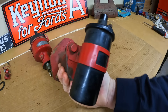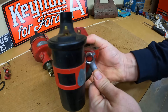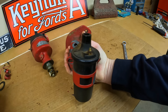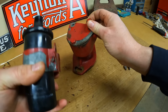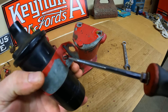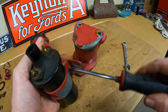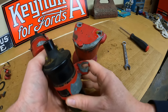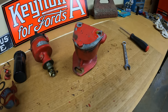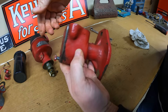The coil comes off the back now, so half-inch wrench. There's a bolt on each side for the coil bracket - there's one, two. We might as well take the coil out of the clamp. There's just a screw that goes through, cinch is tight. We're not going to abuse this coil because it is still a good coil - at least it was last time I drove the tractor. We can take the third bolt out and the cover here will come off the back of the drive housing.